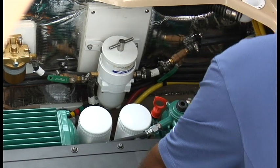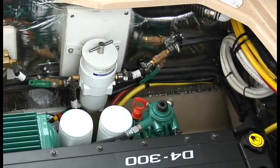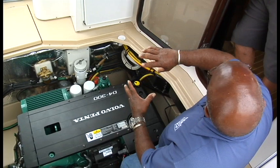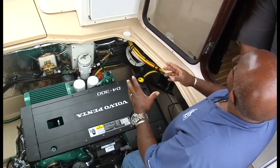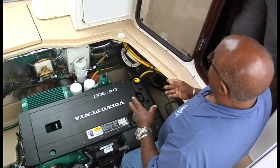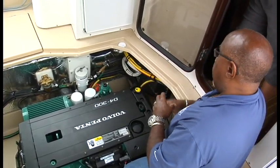Then you're going to get your oil filter wrench and spin off the secondary filter — that's under this black ring. Unscrew it just like you do an oil filter on your car. What I always do is when I change a fuel filter, I pour it into a white bucket and I'm looking for moisture, contaminants, anything like that. That filter is going to tell me if it's got it. If you see contaminants, we've got to address the tank. If you don't, put the fuel back in the new filter, lubricate the seal just like an oil filter, and screw it back on.